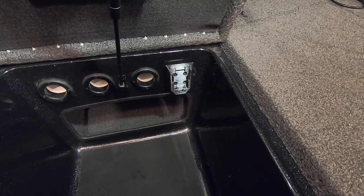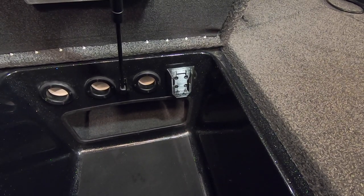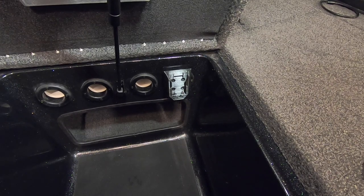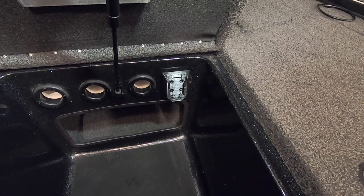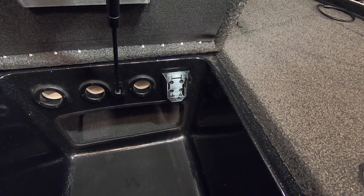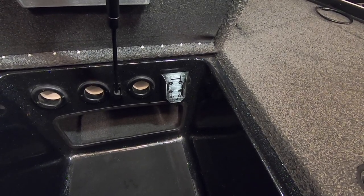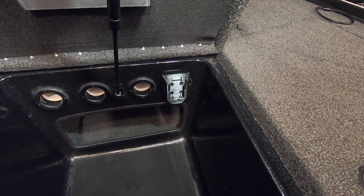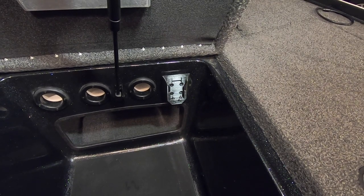I'm here in the center storage area of my boat and I have a Sea-Lect adapter - it's a battery adapter specifically for a Dewalt 20-volt battery. I'm using this battery adapter and a Dewalt 20-volt battery to power the LiveScope. The LiveScope black box is rated up to 36 volts, so you can power it even more than this, but I'm doing a 20-volt system. I ran it according to what Garmin told me I could do. I actually went to Garmin World Headquarters here in Olathe, which is about six miles from my house, and I talked to them before I did all this installation. They told me they would recommend that I only power the Garmin LiveScope black box with the 20-volt, as the 93 SV units are only rated up to 18 volts. So I ran the other graphs off the cranking battery at 12 volts, and I'm still getting between 12.4 and 12.8 volts pretty much all day.